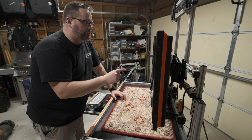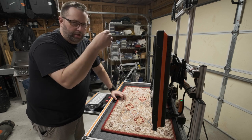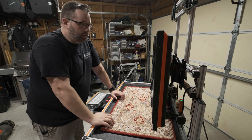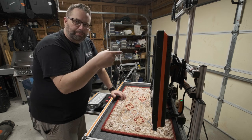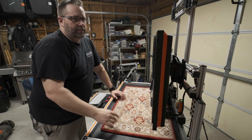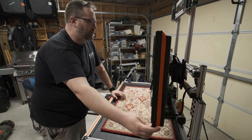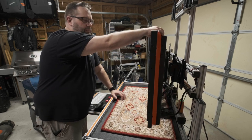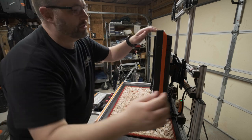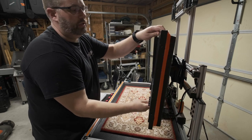One feature I wanted to incorporate with this new build was a little bit of movement in the video monitors. Usually you're on baby pin mounts with friction or ball mounts, but my design uses television mounts from Ergotron. They offset a couple of inches so the monitors sit towards the front of the cart rather than hanging over the back edge. The nice thing is it allows for a little bit of panning left and right — they can tilt into each other or tilt out to the side about that far. And there's a knob on the back so you can tilt up slightly or tilt down.